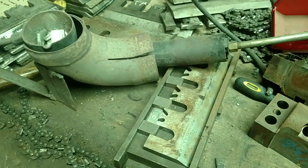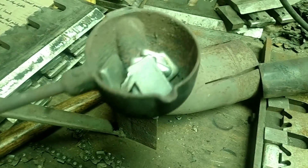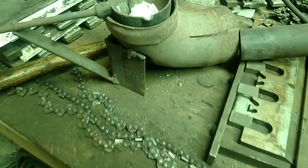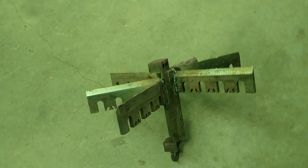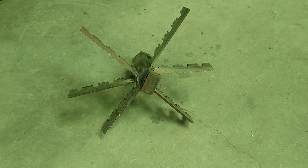Dean wanted me to show his patent — he did not get this off Amazon. This is a weed burner, a propane weed burner, an elbow off a skidder exhaust, with a couple chunks of angle iron and his ladle. He sets that on there, fires up the weed burner, blows the heat up through it, and that's how he melts the babbit. Do not look for it on Amazon. I hope the bark boat anchor works — it's fairly heavy, but Garrett said with the current and if you catch a big sturgeon they'll pull pretty hard. I just threw it together and started welding.